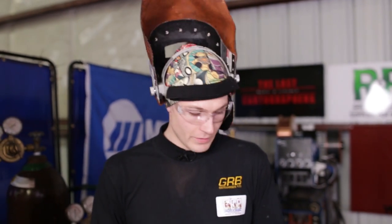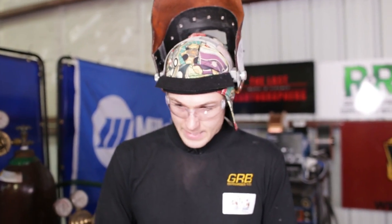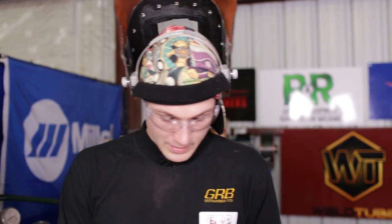Some companies will check your joules to see how much work you put in. What they do is take an amp meter and a volt meter, put off different weld procedures, and also use a timer. When you start welding, they'll calculate the average amperage and voltage over time, and when you're in the shop welding they'll measure the distance of travel. They'll do the calculation and figure out how many joules were put in.